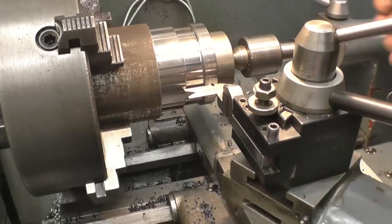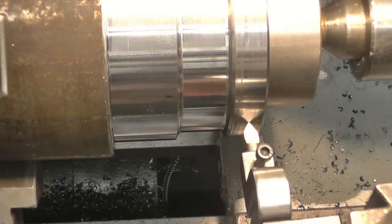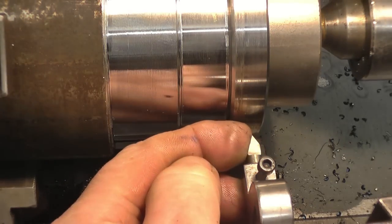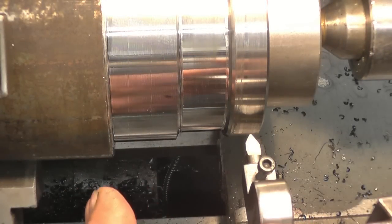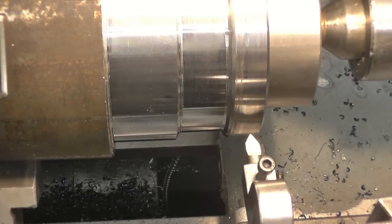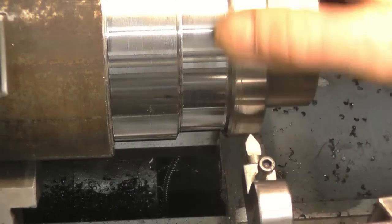I'll bring the camera in so you can see that. The tool is a perfect fit in the slot, square against the job, which means that tool is going to be at the correct angle — 90 degrees to the job. The cut's going to be put on that way with the compound slide, so it's only going to be cutting on the front edge of the tool. With the lathe being metric and the thread being imperial, I'm not going to disengage the feed nuts. I'll mark this up with blue and take a real light scratch cut just to make sure we're cutting the right thread. The idea is to measure twice and cut once.